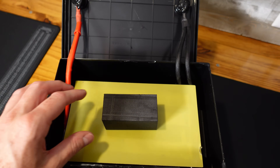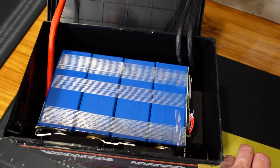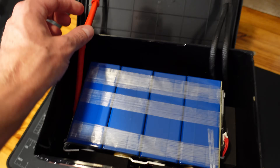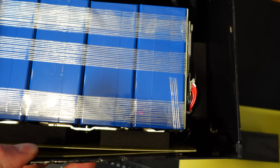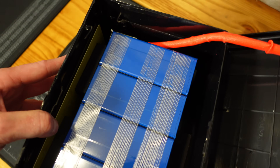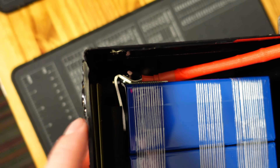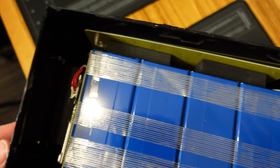Here's a quick look at the battery before I pull anything out. We have this piece of epoxy board on the top to protect it from the lid. We've got one positive and two negative cables, and four aluminum case prismatic cells. They are padded in pretty well with foam on all sides. This positive connection here is bent at a somewhat unusual angle, but there is epoxy board on the side to protect the cells.